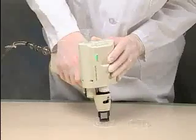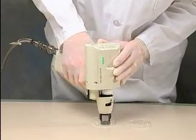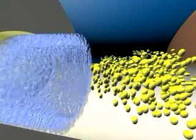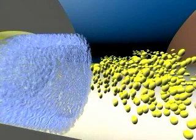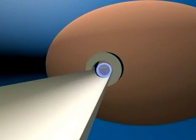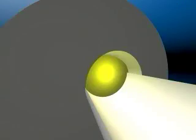When the gun is fired, the pulse of helium sweeps the microcarriers from the inside wall of the cartridge. The particles pick up speed in the acceleration channel, then spread out as they travel down the barrel. The barrel opens as a cone, causing the gas to be pulled outward, reducing the shockwave. The particles maintain a high velocity and are fired into the target.